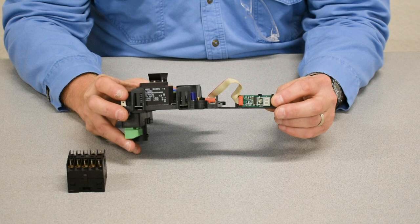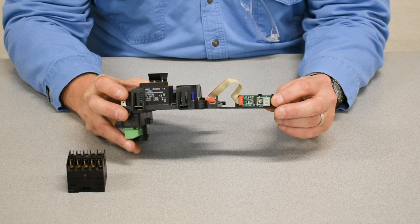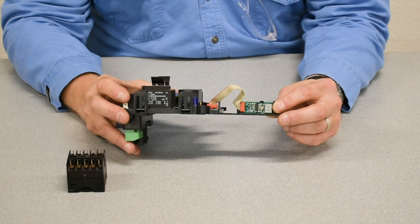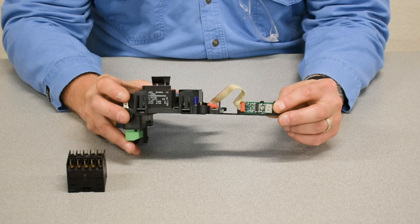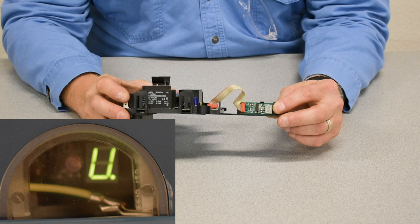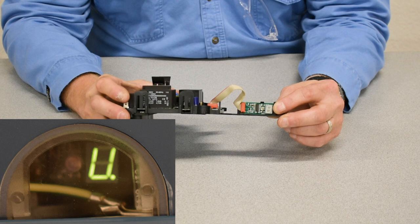The seven-segment LED here will produce symbols. It will produce the symbol 8 when e-stop is engaged. It will produce the center of the figure 8 only when it's ready to run, right after e-stop is disengaged and power is allowed to flow to the motor. The hoist will display its software version running on the board — it looks like the letter U, but it's really meaning a V; it's what the seven-segment display can produce — followed by a three-digit number. Very typical is 183, meaning 1.83 software running on the board.